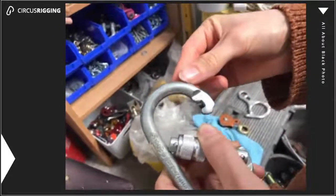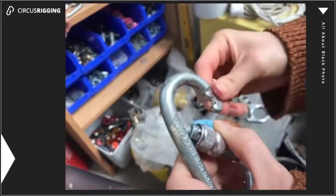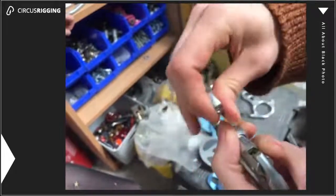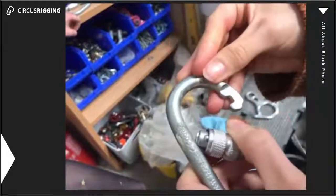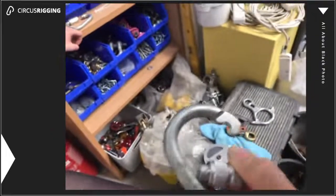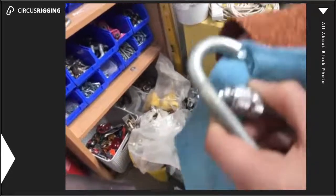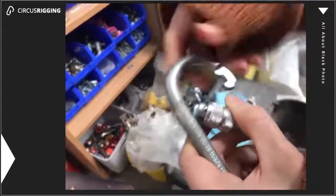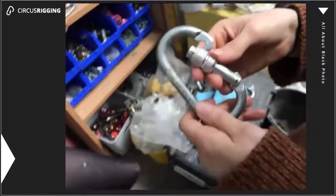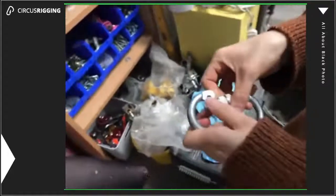And it's pretty unlikely you're going to see any cracks, but because the material's a lot thinner there, you might actually see some cracks. So give it a good clean over, maybe even give it a rub over with something like a Scotch-Brite pad, just to get any dirt off. Okay, so we're fairly sure that there's no damage there. So now you can let the gate go back to where it should sit. Yeah, screw that back. So return it to how you'd expect it to look.